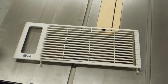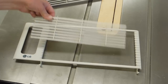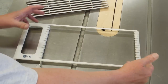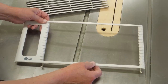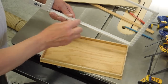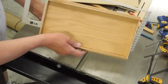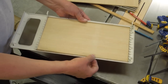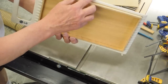These louvers are cosmetic and they're actually a restriction to air flow. I remove those. This will now be boxed out to be a holding frame for my filter, and the boxed-out section will add support to this door. We have a lip on the back side of this air conditioner door, and a recess — this is actually part of the bottom louver. This will go underneath the top section of this door and will be glued in all the way around. That will provide support for this air conditioner door.